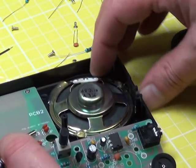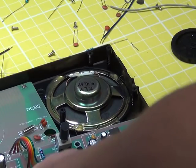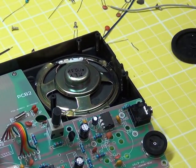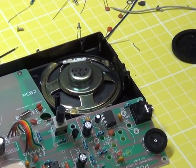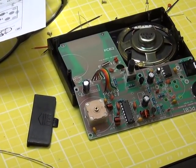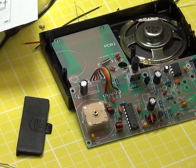We've put all the parts in and put the ribbon cable in. We've found that one of the lugs on the tuning capacitor is slightly wider than the other lug, so that's the way it obviously fits, because we can't read the Chinese instructions. Looking at the circuit diagram, it appears to be stereo to headphones, mono to the speaker.